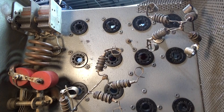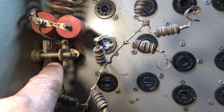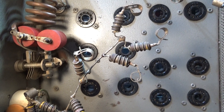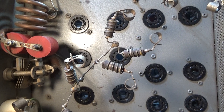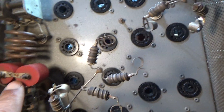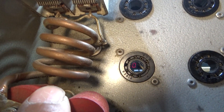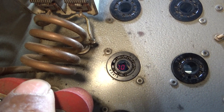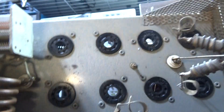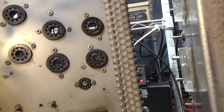Let's just say 10 meters only. Here's a smaller tune cap because you don't need a lot of capacitance, especially for the tune on a 10-meter amp — you need much more as you go up the band. This one here has much heavier blocking caps, these two commercial type blocking caps, where this has just two discs. For 10 meters only, there's your four turns of coil. This one got a much heavier coil and it's spread out — that's why it needs four. Over here they're very close together so it can get away with three. And then that's the load cap.